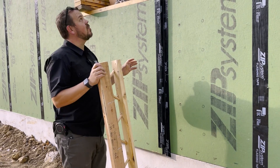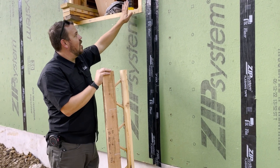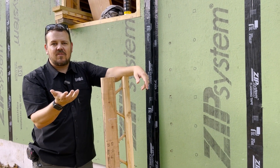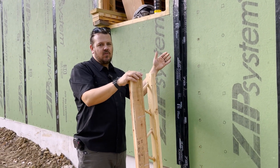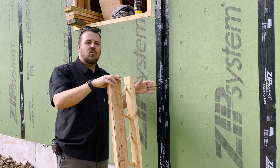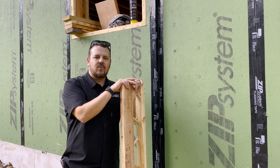The architect already had a stacked window assembly here and two stacked window assemblies on the far side at the stairwell. So we're able to use that as our point of reference — our window plus window trim gives us the width of the stack assembly. We'll do it here and on the far side. The only real difference is extension jambs that are already being made out of drywall on three sides — they're just a little deeper.